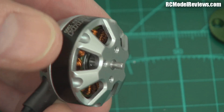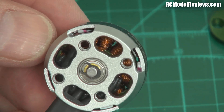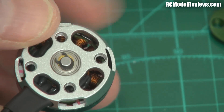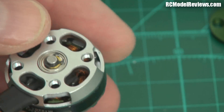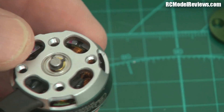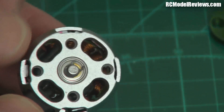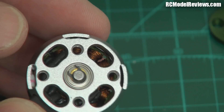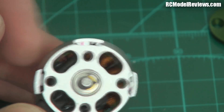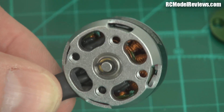You can also see that turned-down shaft for the prop adapter on the Quantum. For the Elite, the circlip turns with the shaft, so you're not going to get a situation where you wear out the groove. There will be a little bit of imbalance though, because you've got one piece of mass that's further from the centre. We'll see how they work out when we put them on the bench and run them up.